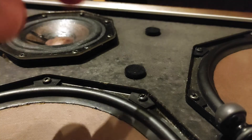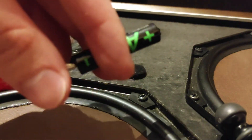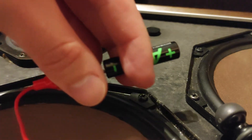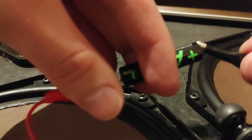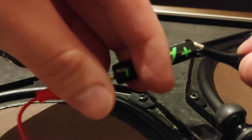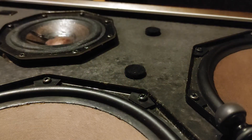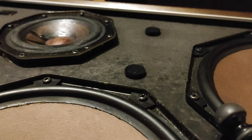So then you just try it. I've put the camera at an angle so hopefully you will be able to see it. You take the battery and you just quickly dab it a little bit on the connection and notice how the membranes move. When I just dabbed there, you can see it pulled the membrane down — this means it's the wrong way, because when you put the terminal to the plus side, it should be moving outwards.